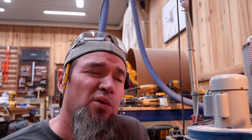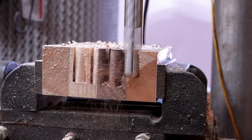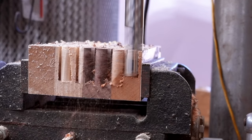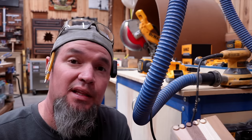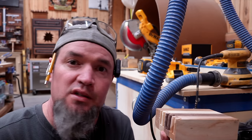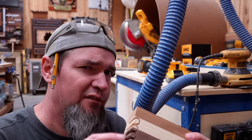This next one got over 2 million views. It's pretty simple — I just showed people how to cut their own dowel plugs. There are a lot of different reasons why you'd want to: maybe you're working with walnut and want the plug to match, or the opposite — you want contrast and make dowels out of cherry — or you're using reclaimed wood and don't want new plugs, or you're putting pocket holes in walnut and want your screw covers to match. They make plug cutters in all different sizes. For this example I'm using Kreg's 3/8-inch pocket hole plug cutter. I think the reason this video did so well is that it's kind of satisfying. I'd make several plugs of whatever material I was using, then take them to the bandsaw, table saw, or even use an oscillating tool to pop them out. A good set of plug cutters will save you a ton of money — have you looked up walnut plugs lately?